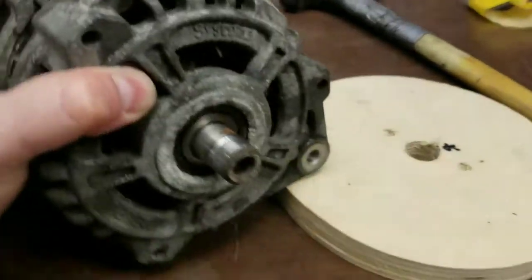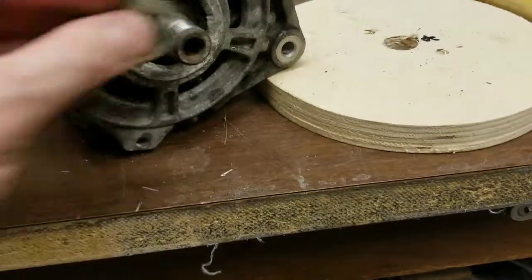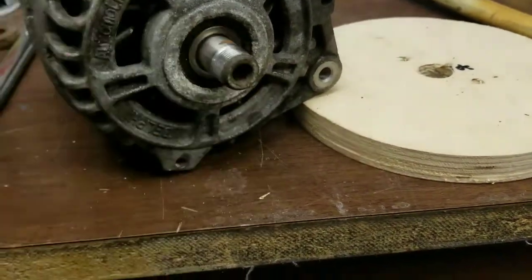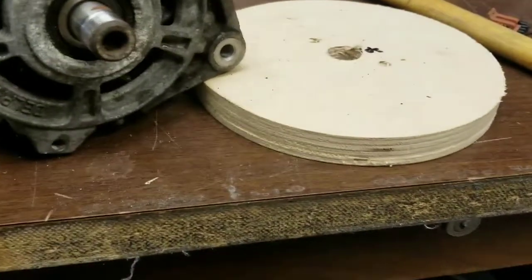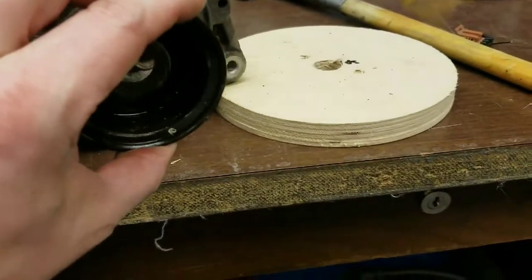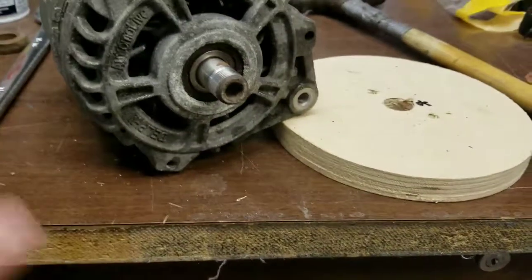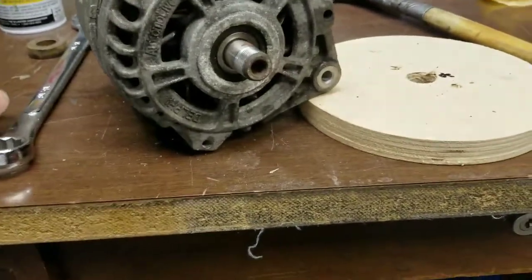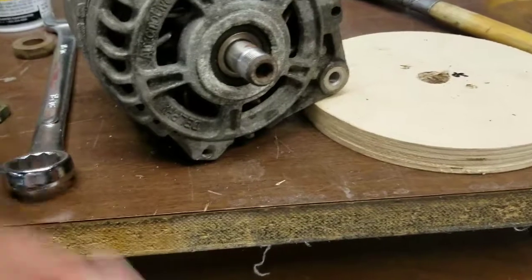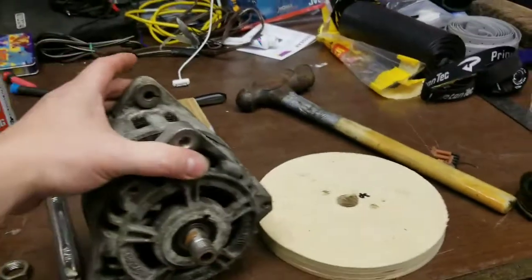You can see you have an allen wrench center and a nut on the outside, so you're going to have to use a 5/16th inch wrench within those confines — that kind of sucks. What I did is I put this in my vice, cinched the vice down, then hit it with a 5/16th impact to break the nut loose initially, and from there I was able to just use the wrench and allen wrench to get it off.